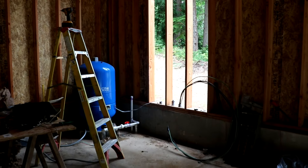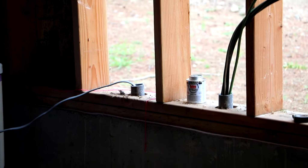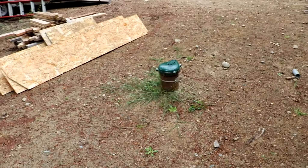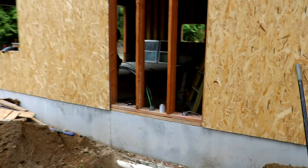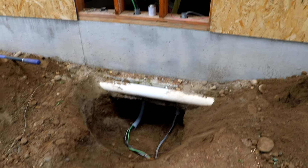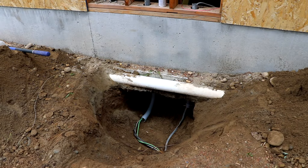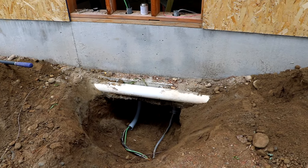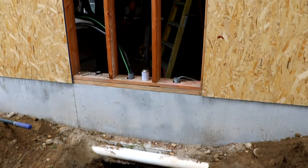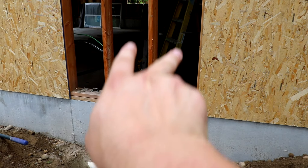As you can see, the temporary shed is gone, the electrical panel's disconnected, and we have two cables and a can of glue, but the cables are sticking up out of that conduit. The conduit goes through the foundation wall. There's my well head, and over here we haven't been able to put that last piece of plywood on because we had to deal with this power panel. What we've done is put conduit inside the concrete under the foundation — the green, black, and white wire comes from my permanent remote meter on the other side of the garage and goes into the new garage, and the other wire is for the pump and the well. I'm doing this so I don't have any boxes or conduits attached to the outside of the garage. This hole will get covered back up with dirt, this piece of plywood will go on the wall, and these two conduits will be the cables that come out of the garage.